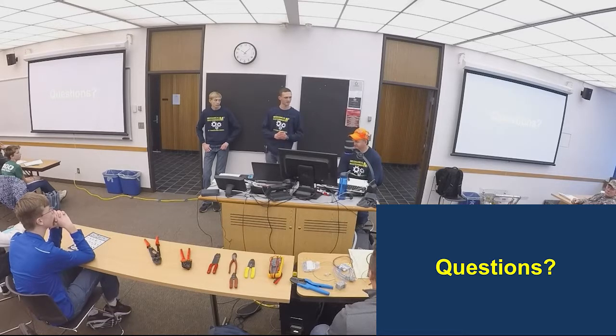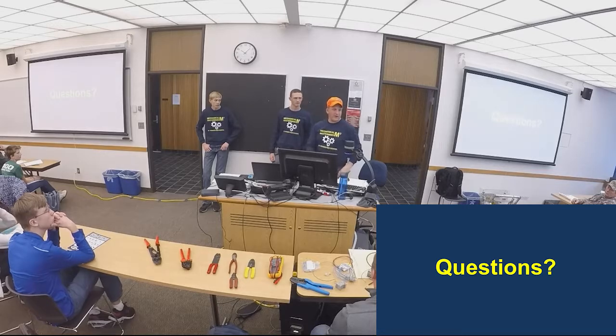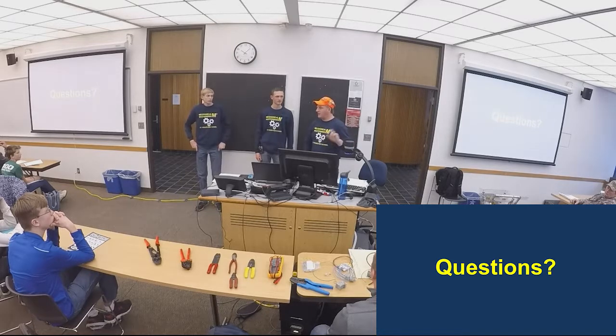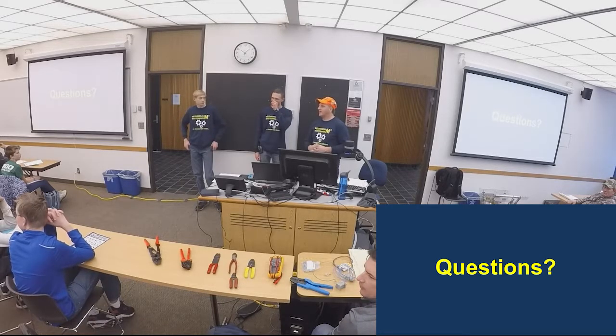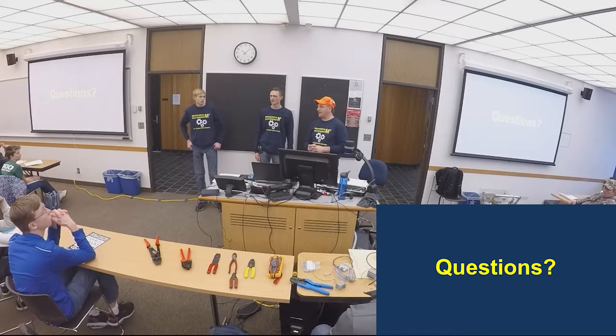Todd? The disadvantage of CAN, there really isn't. It's just a matter of choice on how you're going to route your wiring. The CAN can be confusing. If one of the wires comes loose, you will lose a lot of things on your connection. So the big disadvantage would be if one of them comes disconnected in your daisy chain, then you'd be in trouble. So it's like the Christmas light example? Yeah, where it's all going through it. Now it depends on where the break is and where the termination is for your loop back on your resistor.